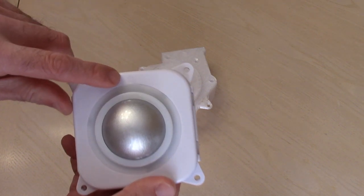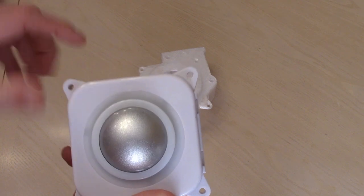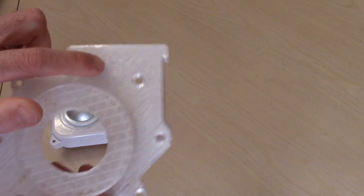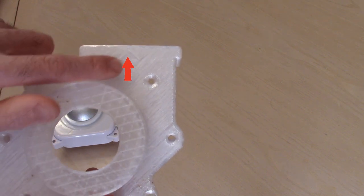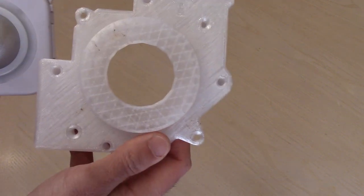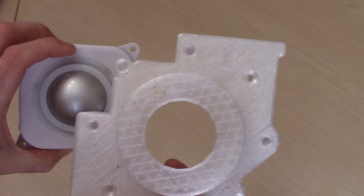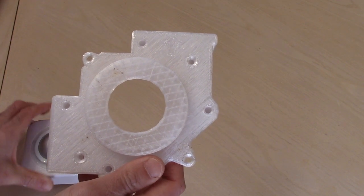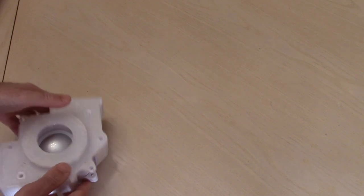And you can notice right up at the top, there's a little arrow. If you look on the 3D print, and even on the original Arcade1UP one, there's an arrow here. This means this is going towards the screen, towards the monitor. So when this gets put inside here, you have to make sure you're keeping this and this correct, otherwise the trackball won't work correctly.